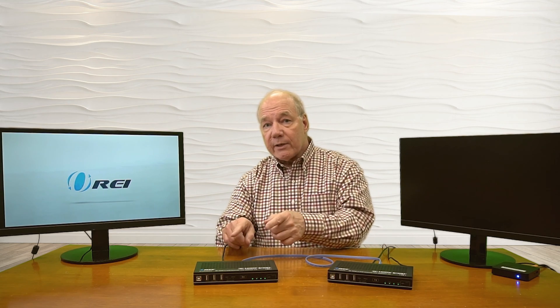And you can separate these up to 330 feet apart, which is a long distance to be sending HDMI media content. There you go. What you're viewing here is HDMI content that's been converted into a signal being sent across that LAN cable and then reconverted back into an HDMI media stream being displayed on this monitor. Another nice feature this product provides is local loopback functionality, which allows you to continue to enjoy the content here that you're sharing with that secondary location.